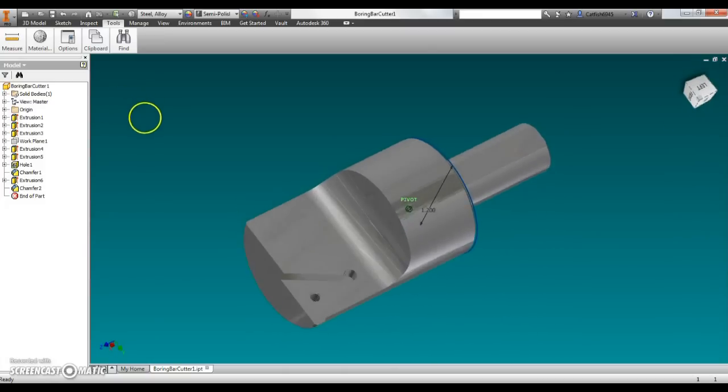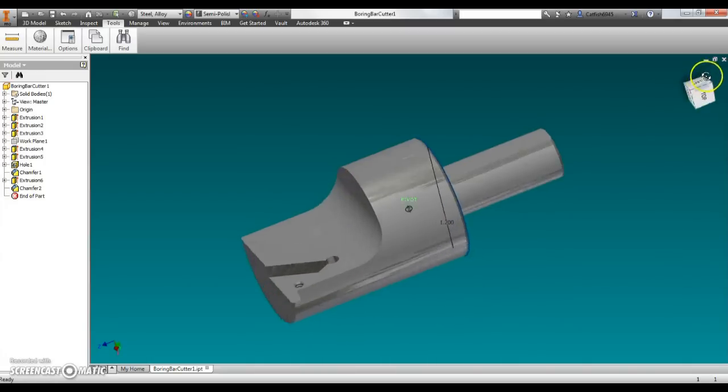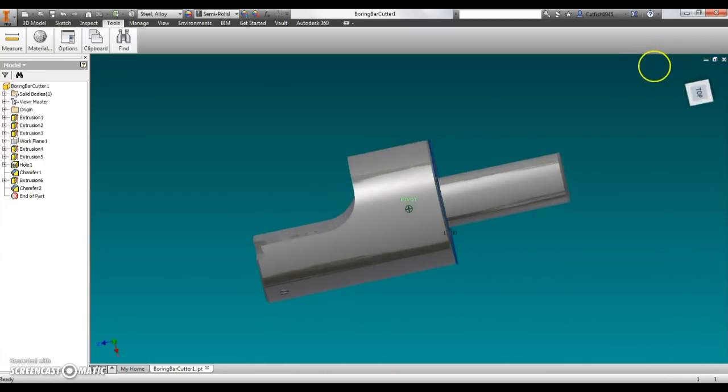We're going to use a TPGB 321 insert for this, and you can see that notch there where the insert will sit. This will be the same insert I use for my dovetail cutters. That way I kind of keep everything the same, which is kind of nice. This will be a little less than 1¼-inch, with a 1/2-inch shank and a nice little cutout. And you can see the cone profile there.